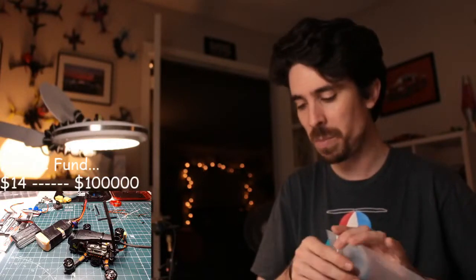That thread, there are a lot of smart folks posting in it. I've been having a blast reading it, because a lot of people are trying to troubleshoot that, unsuccessfully, unfortunately. But the big thing that most people seem to be doing to fix it is going to 24 kilohertz, which I am going to do, because when I went to 48, I felt no difference whatsoever. And I would rather have the additional braking that you get with 24.